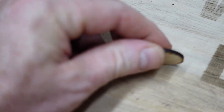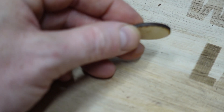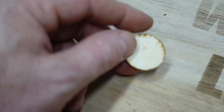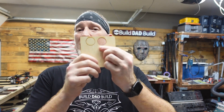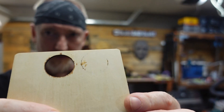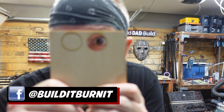It's kind of hard to tell in this light, but you've got kind of a brown edge, not black, which means it wasn't really just burning the crap out of it — so that's a pretty decent result. A little burning on the back, but I think that's from this plate right here reflecting back up. At 200mm/min and 90% power it didn't cut all the way through, but it almost did. We slowed it down to 100mm/min and bam — right there. Focus!